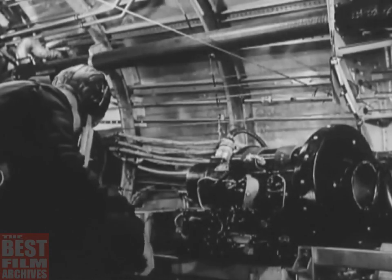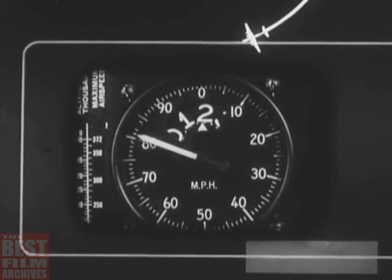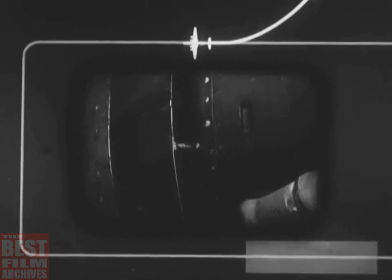Five minutes before landing, the engineer tells the tail gunner to start the putt-putt. The ship enters the traffic pattern at a 45-degree angle to the downwind leg. Altitude is 2760. Speed is 180. Here, the co-pilot lowers the wheels. The mixture controls are set to auto-rich, and the cowl flaps open 15 degrees. At the end of the downwind leg, the speed should be about 140 or 150, and at least 3 generators must be on. The co-pilot lowers the flaps 15 degrees.